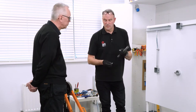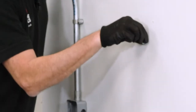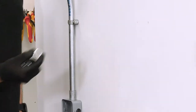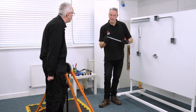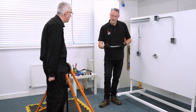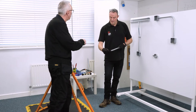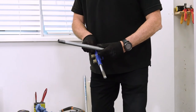My personal preference is the lock ring. The reason being, if you have the nut, the edges could catch onto the surface behind the conduit. If you use a lock ring, which has a knurled edge for grip, it doesn't do that. As you can see, I have now threaded this — it's quite an extensive amount of thread, approximately 39–40 millimetres long. To gauge it, put a mark from the end of the conduit approximately 75 millimetres — when the end of your guide approaches that mark at 75 millimetres while threading, you've cut the required amount of thread.